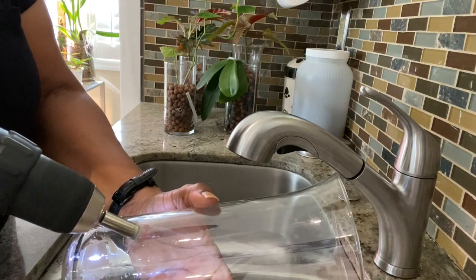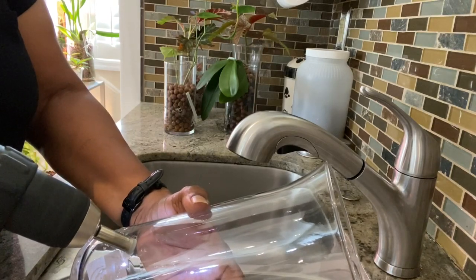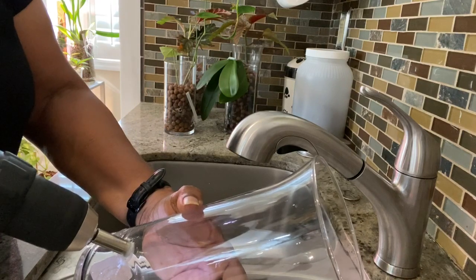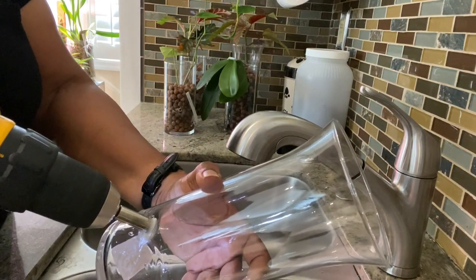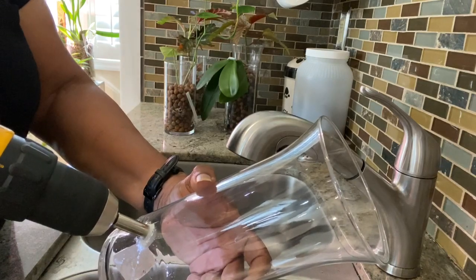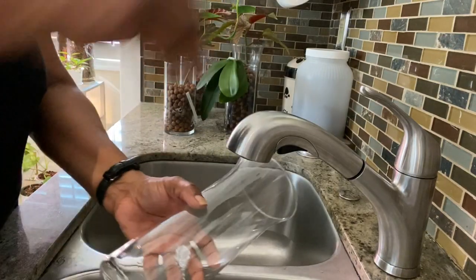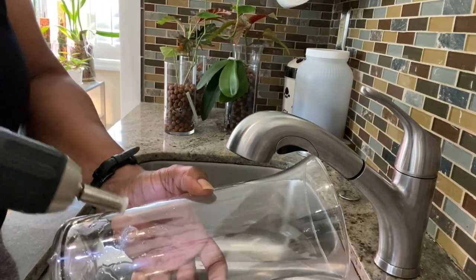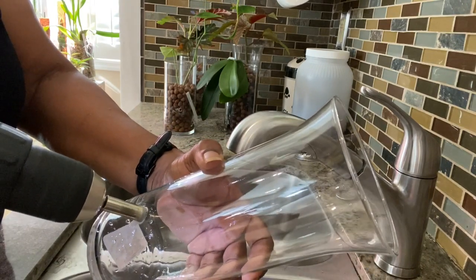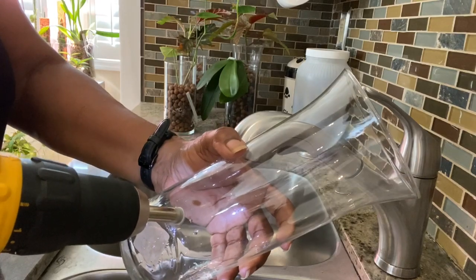You're going to need to use a little pressure, but not too much. The pressure is kind of tricky — if you're not making progress, you're not using enough pressure. You'll actually be surprised how much pressure this glass can take. But you don't want to use too much, because you're not trying to break the glass; you want the drill bit to do the work. As you make progress, you'll see that the entire tip of the drill bit has formed a circle and is in full contact with the glass, and that groove helps keep the drill bit in place. You can hear the difference when the glass initially breaks — it's going to sound a little different — and once you hit that point, slow down just a little bit with your drill speed.